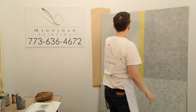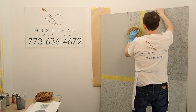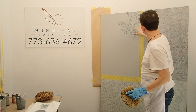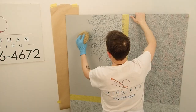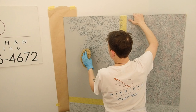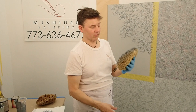Like ragging, you want to be careful not to overlap directly on the pattern you just did, but you are blending your areas a little bit. Notice how it doesn't look like separate pieces — it looks more consistent. What I'm not doing is going like this; I'm starting in one area and moving out. If you're doing this right, you don't need to press very hard. You want to rotate a little bit each time, try to avoid doing the exact same thing. I'm only using part of the sponge — don't try to get your whole sponge saturated or you won't be able to control your pattern.